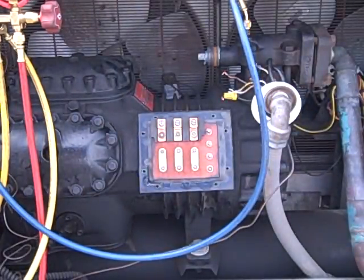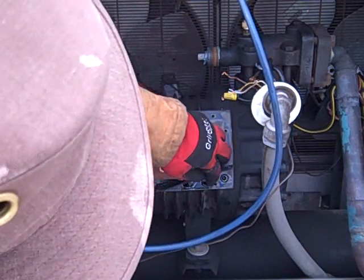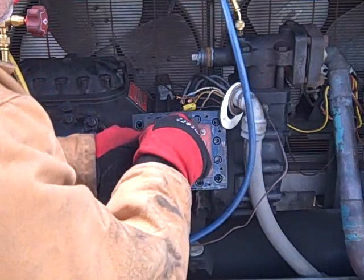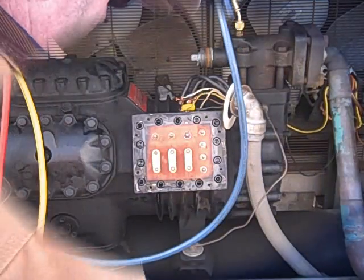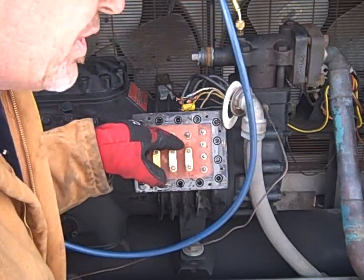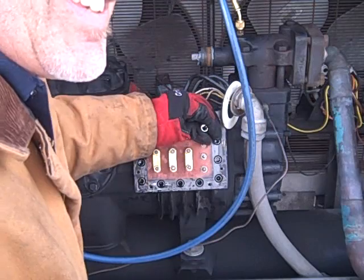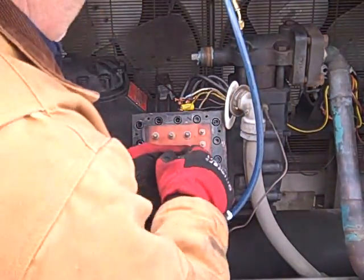You can see the oil dripping there — I'll bet you can see it on the camera. Look at that, boys. There she is, bigger than life! What we've got here is it's leaking behind the plate where your wires go into your motor and come back out. You can't hear it leaking on the camera, but look how loose these are — these things are just finger tight. If I loosen them more, you can certainly hear the leak a little bit better. So what we've got to do is torque all these down. Just about everything is loose.